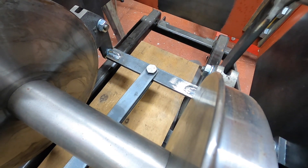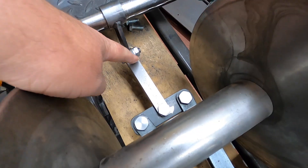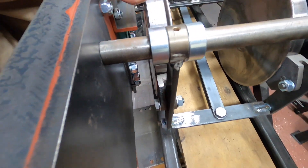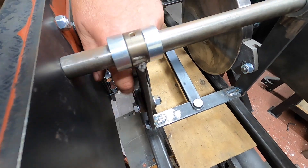We've finally got the brakes done! As you've just seen, I've turned a load of pins that are now fitted to the locomotive. I used some 19mm hex bar for the links, giving a slightly bigger head — because some of you were worried they'd fall out, so with a bigger head there's no chance of them falling through. I also turned down some 17mm hex bar for the link from the brake link bars to the layshaft drop-down link, and also for the brake blocks to replace those, so now they are pulling on the flat of the bar, not the thread.